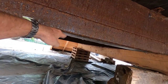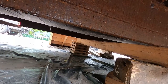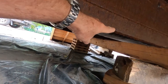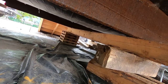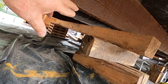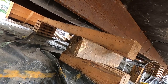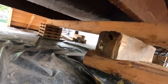We try to get this beam right here level so that everything underneath is level. We don't worry too much about discrepancies in the wood and metal up on top — those iron beams are not perfectly straight. I aim for plus or minus an eighth of an inch, which means I'm within a quarter of an inch, which is perfectly acceptable.